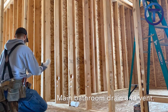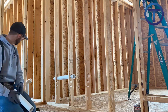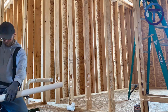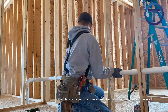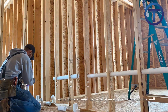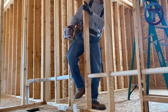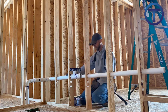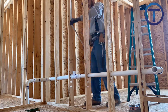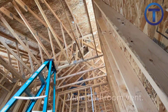This bathroom group was unique and challenging because the HVAC contractor put the return air right below that wall — I couldn't run pipes up into that wall. So I had to bring the lavatory drain up and around, coming through the studs. This is far from ideal, but it works. I've got the drain coming through the wall, then I put a vent in there with an arm that continues on — you can see it reduces from two-inch to inch-and-a-half for that arm to the sink — and then I run a vent up and that goes out the roof.